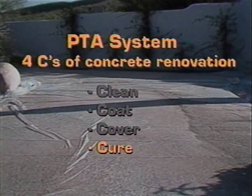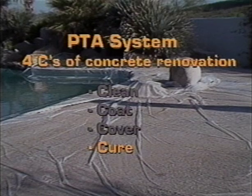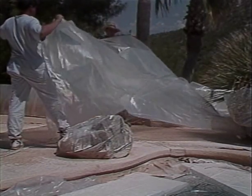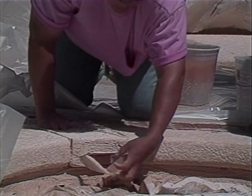The last C is for curing. Because PTA, Keystone CoolDeck, and Marquee are cementitious materials, they must be cured. On existing concrete applications using Marquee, do not use more cure. To properly cure both Keystone CoolDeck and Marquee, cover the deck with clear plastic sheeting of 1 to 2 mils in thickness. The surface should be covered immediately after the final troweling pass. It is better to cover the deck with plastic and uncover only those areas that need cleaning to minimize moisture loss — in this case, the brick inlays had to be cleaned of any PTA that was under the masking.